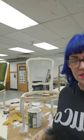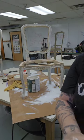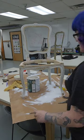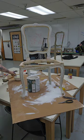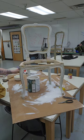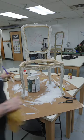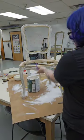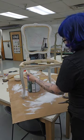Until then, I'm just going to continue working on the paint. We're going to get another solid coat on this. This one I'm going to put on a little bit heavier, and I might find myself wiping away in between like sections this time so that it doesn't dry too fast, because right now, this is dry. Like, I'm scratching it with my nails. It's not coming off. It still needs to cure, but it's dry enough to touch and handle with my hands and move around, because we've just been putting on these really thin coats.